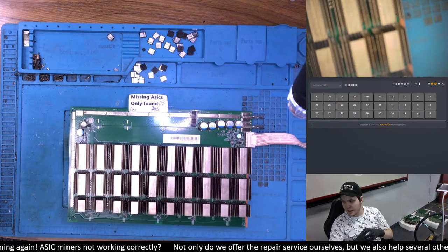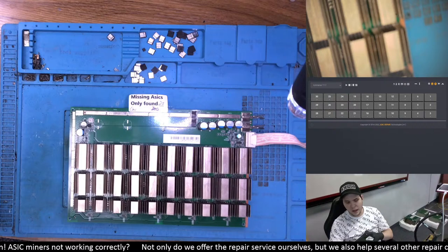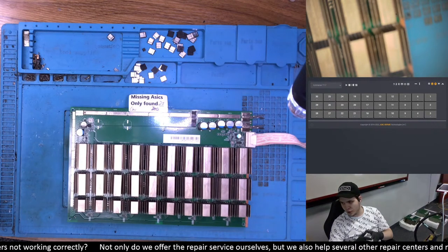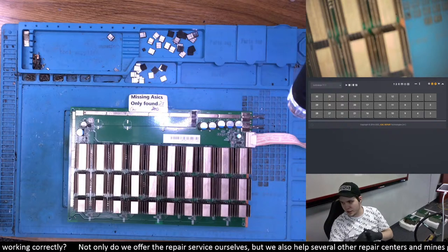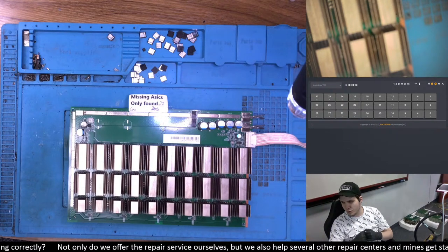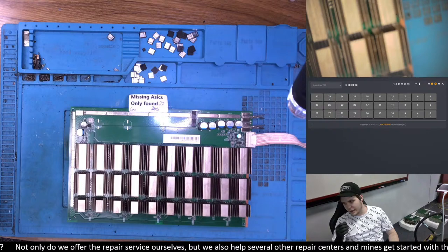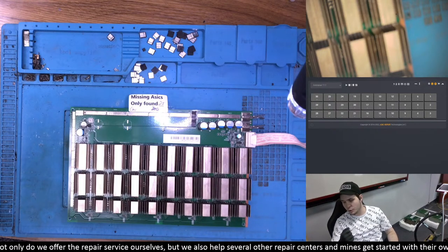The Stasic looks very impressive — I believe it uses a PIC controller essentially inside the tester, which is pretty efficient. There is one testing mode I came to really appreciate on the Stasic tester. It made me realize how powerful that same equivalent feature is on the Arc tester too, which I wasn't using much in my previous diagnosis but now I enjoy a lot. That would be the testing without pulling chips mode.